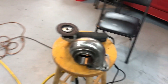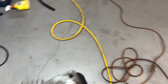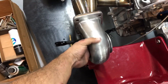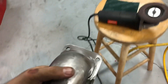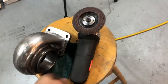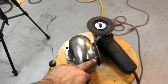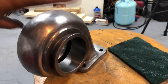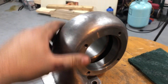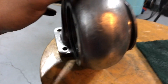Since you saw the time-lapse right there, we tried to go around as much as possible into the areas, especially that are going to be seen. Like I mentioned earlier, this isn't going to be facing the center of the car — only about half of it is going to be easily seen. It's going to sit like this in the engine bay. So the top portion, which is the main area that's going to be seen, is almost perfect — we might touch up a few areas but nothing major. As the next step, since we already used the flap disc, I like to go over it with a little bit of Scotch-Brite. You can see it's really rough with the cuts, but it's almost smooth. After Scotch-Briting, it's much duller than before, but now with the finish all one even texture, you can actually see all the imperfections and where the high and low spots are.